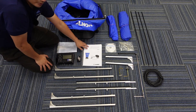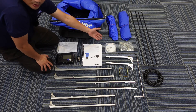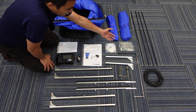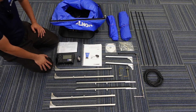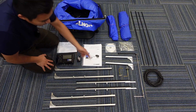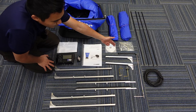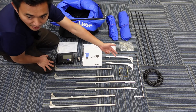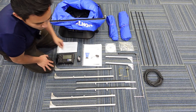We have a manual handbook so you know how to use the unit, and we have software so you can download all the data that has been logged. To download the data, you can connect the manometer to a computer using a USB cable. For pressure applications, the unit comes with two static probes and one pitot tube. This pitot tube and static probes will be used together with an 8-foot length of Norprene tubing, and it comes with two units.